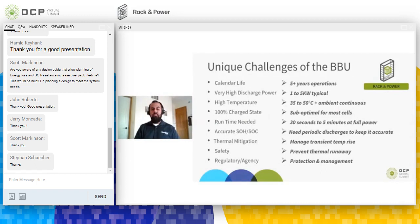Another big issue with BBUs is the ability to have accurate state-of-charge and state-of-health data. Most fuel gauges require discharge and charge cycles to stay accurate. Since BBUs are not discharged often, the fuel gauge can become stale, so we need ways to periodically do partial discharges while still being ready to handle a backup event. This may require BBUs to have extra capacity. Thermal mitigation is also a big design challenge given the hot ambient environment and the very high discharge output.